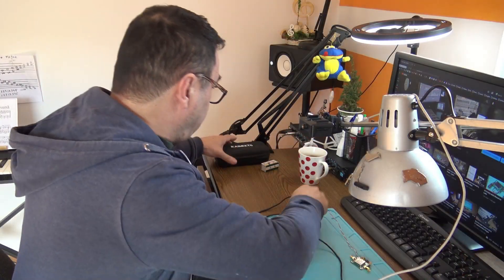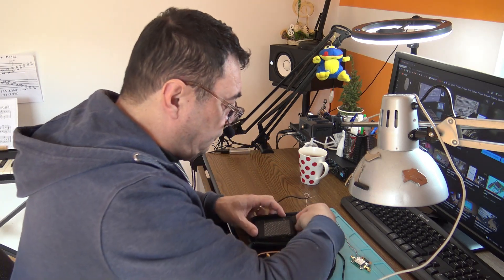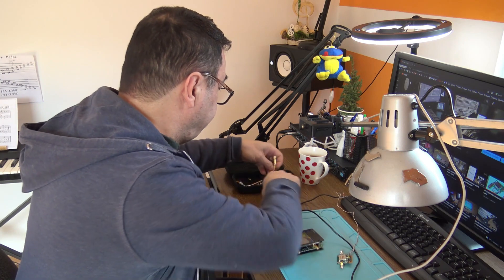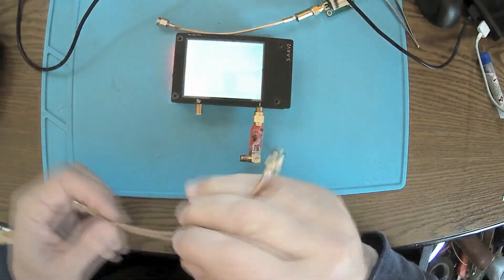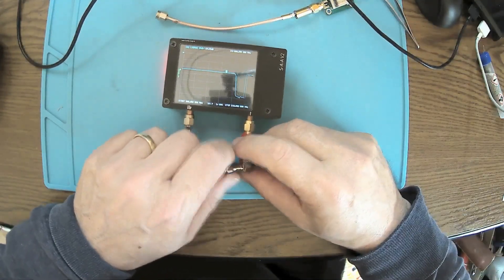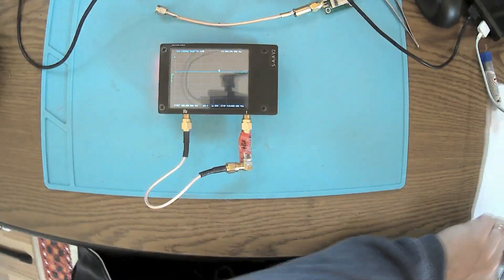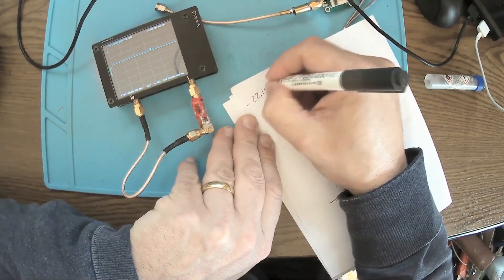Let me have a test with the nanoVNA to see about the amplification at 2.9 volts — a very simple test. 22 dB attenuator. First, let's have this attenuator online — so we have 24 dB here, it should be 22. It's the connectors or something; I need to check all these cables of mine. So we have a -22.17 attenuation — let's write it down: -22.15 dB attenuation.